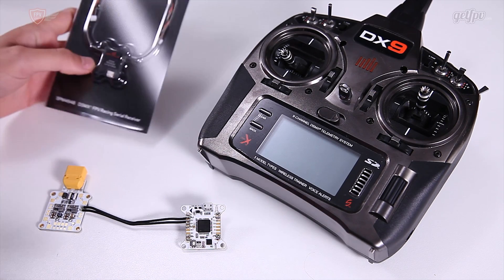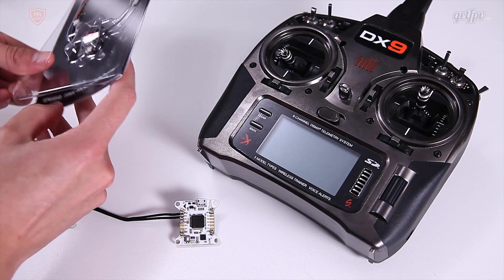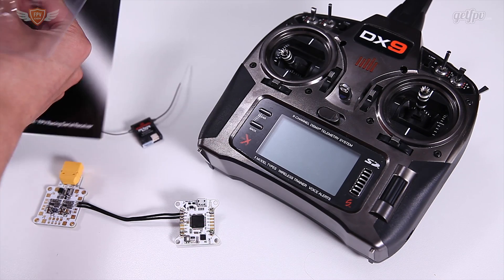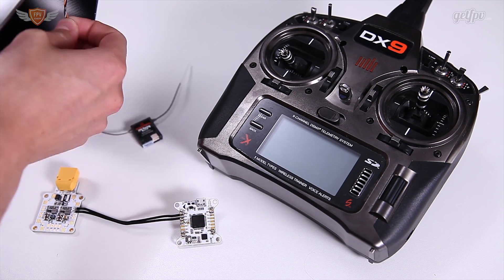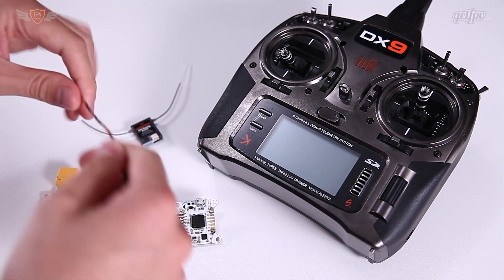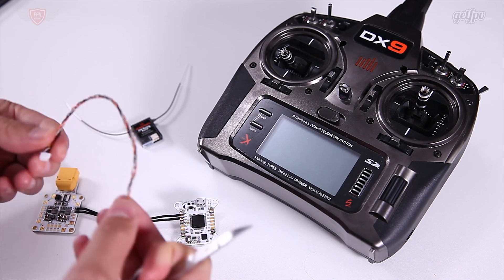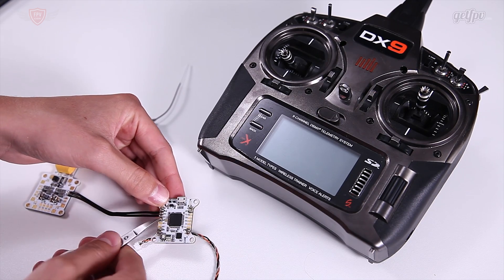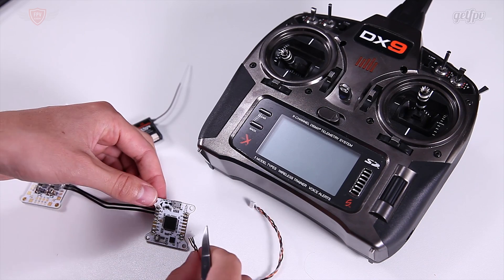The first thing you want to do is solder your Spectrum receiver onto your flight controller. The flight controller I'll be using in this video is the LUX V2, so if you have a different flight controller you might want to look up the details online and figure out where you need to solder your cable onto. We're going to grab the scissors and cut this in half because we do not need the entire thing - the LUX V2 only allows you to solder the cable onto it, so you can't plug this in anyway.